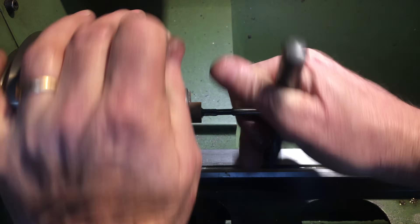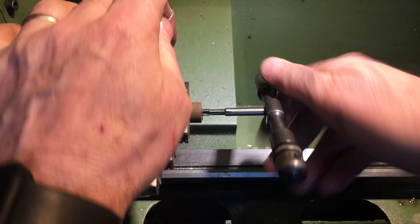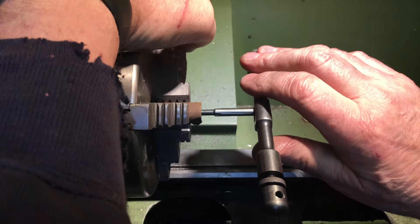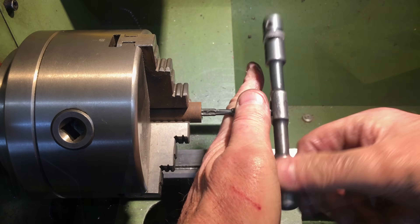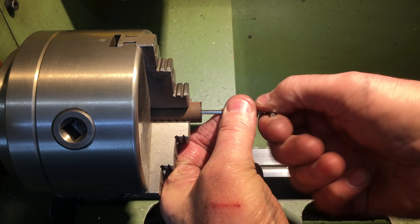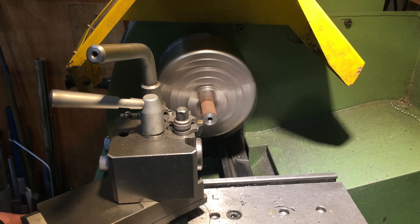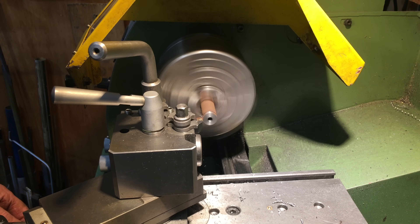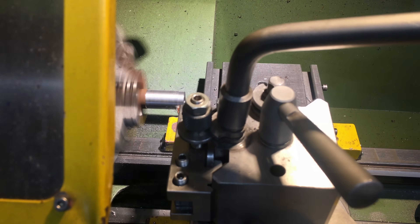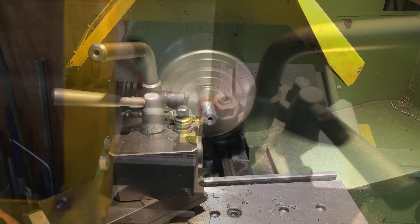After end-centering a length of 15mm bar I drilled and tapped it to M6 to accept short grub screws that have now arrived from the supplier. The next task was to machine the outside diameter to the tapered intersection diameter. That involved a bit more maths and, to be totally honest, a little bit of luck — well, a lot of luck really.